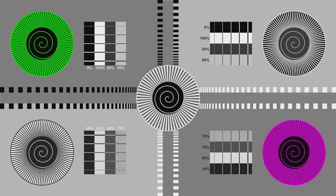And then the third aspect we look for is something called linear light scaling. Today, all scalers scale your gamma-corrected image. Don and I have a scaler that we did in about 2004, which I think we received a patent on, that actually scales in linear light. So again, everything on the market today will fail that as well. So of the three tests we have on the pattern, only one of them passes today with current generation equipment. Wow. So we're future-proofed. You should be able to detect when scalers become available that can pass that last test.